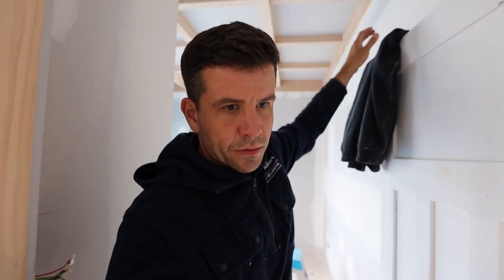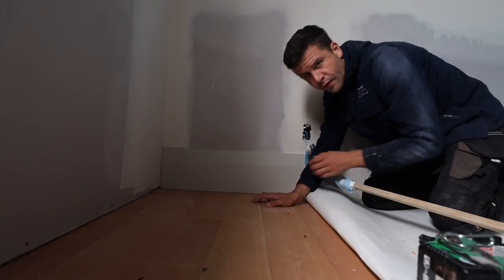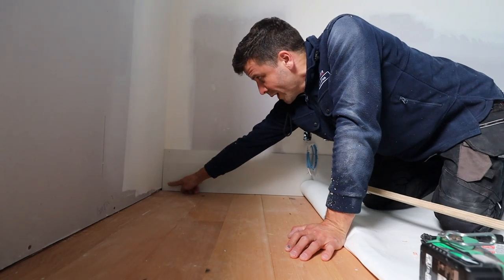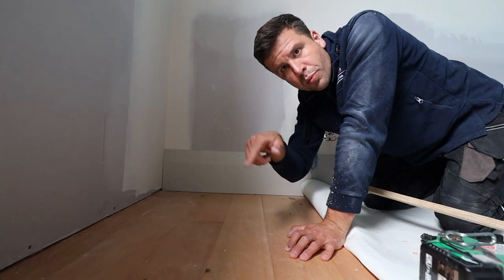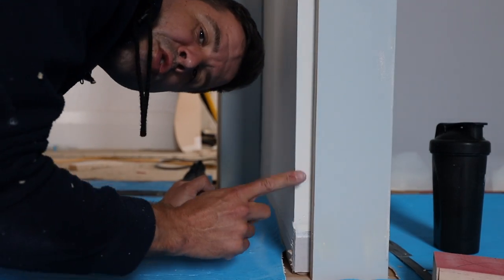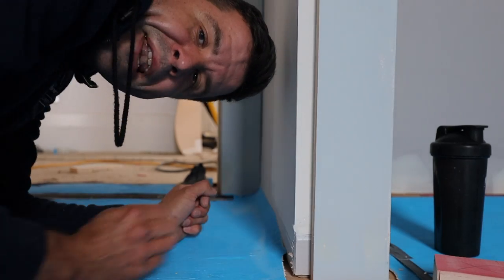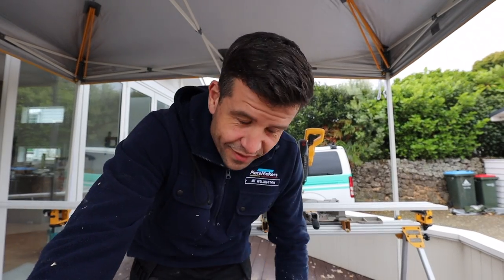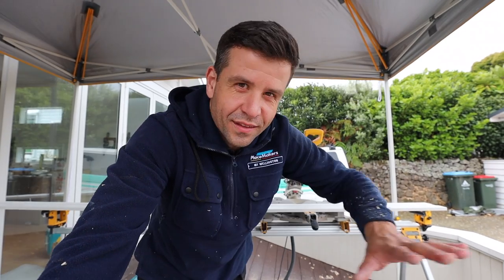We're having a bit of trouble with the skirting. That piece is on there and it's perfect — very happy with that. But of course we're going to have an internal corner that we're going to have to cut on an angle and then cope. We've also got an external corner that we have to cut a miter on. Now there's no problem cutting miters, that's part of our job. But when your drop saw isn't accurate and the skirting is this wide, it's proving to be difficult. Stay with me — this is leading to me buying a new drop saw. There's a legitimate reason here.